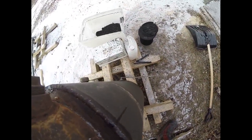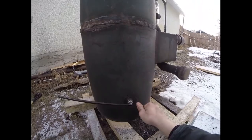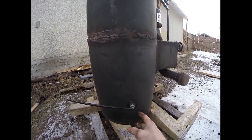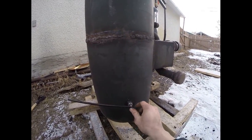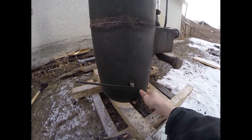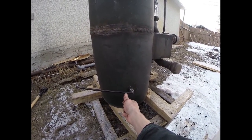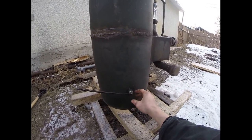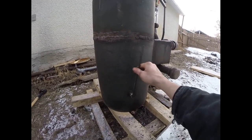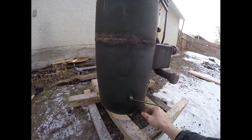This was very simple — I took a half-inch bolt, welded the nut to the outside of the vessel after drilling a hole through it, then screwed my bolt through. If I were to redo this, I would have welded a nut onto the handle and double-nutted it on this side so the whole thing could pull apart. But it's no big deal — if I ever have a problem I'll just cut it and it'll screw out.